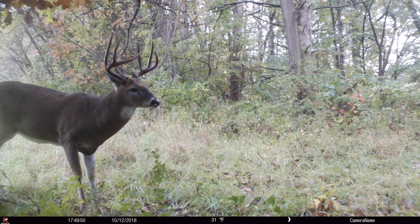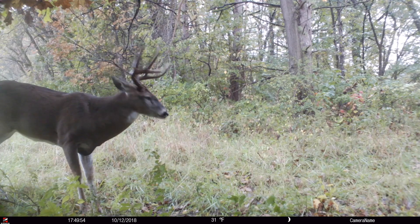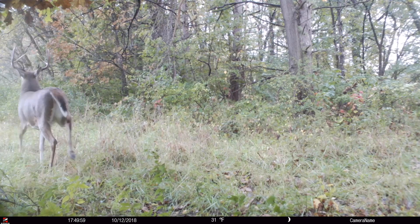You just want to place the camera up against something where it's physically impossible for it to detect any infrared radiation change. Put it against an inanimate object facing the object and let it run for 15 or 20 minutes. Go back, grab the camera, shut it off, pull the SD card out. You should only have a couple of photos — maybe one when you turned it on and set it down, and one when you picked it up and turned it off. If you have nonstop pictures for the entire five or ten minutes, you do in fact have a bad PIR sensor. There's an element that is burned out and that camera probably needs to go back to the manufacturer for warranty repair or replacement. If you're dealing with us, make sure you send an email.